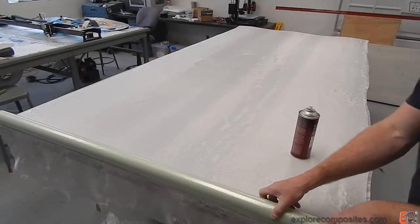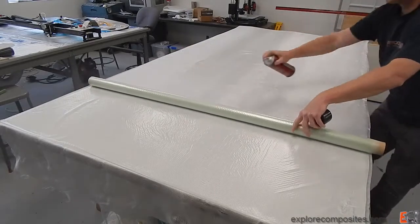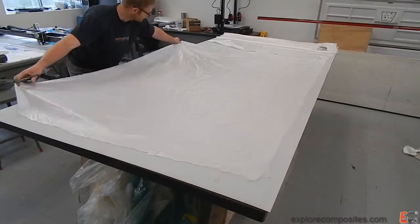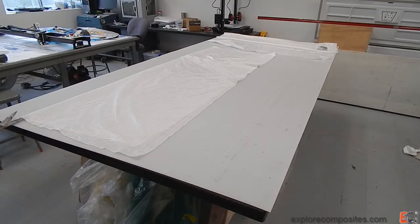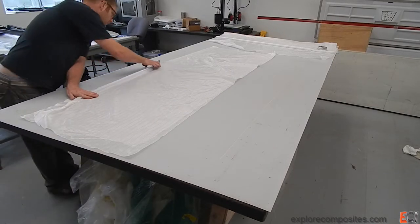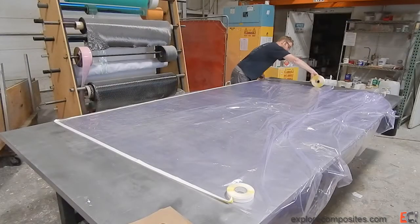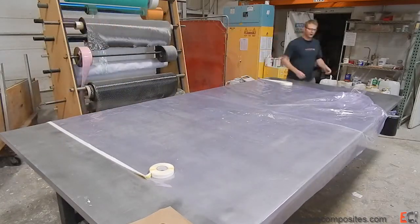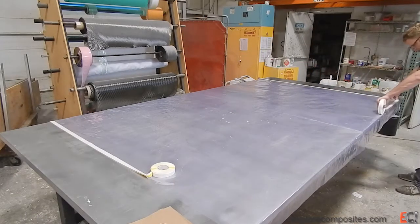From there, I started preparing the process materials for vacuum bagging. Here is the breather with P3 release film getting spray glued to one side of it — this is a nice way to do that. Then preparing the peel ply, just making a neat kit. This is just regular nylon peel ply and a pretty dull pair of scissors. It's nice to have all of this kitted so that it's easy to go on and makes the bagging a smooth operation. I'm doing the sealant tape on the bag, which is a great thing to do for any bag you're doing by yourself or where you're in a hurry — a nice way to solve a problem early on.